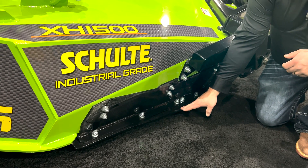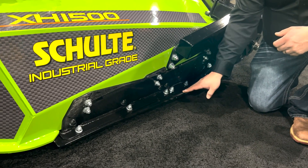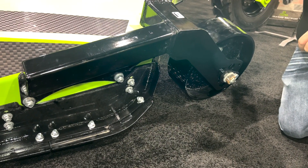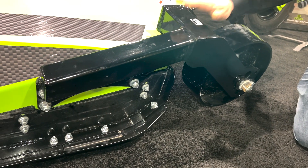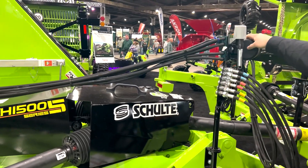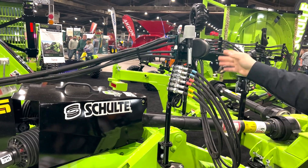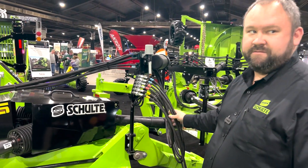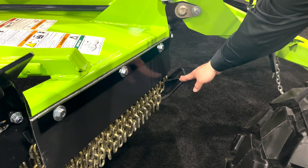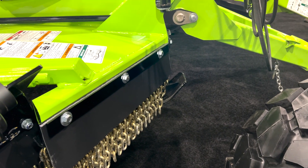One and three-eighths inch threaded adjustment on your wing height. Rear replaceable cast iron skid shoe, as well as front and replaceable side skirt. Right and left gauge wheel is optional on the Series 5 cutter. Newly designed hose organizer which can be moved and adjusted side to side according to the tractor you're using with the machine. Replaceable centre cast skid shoes as well, with rounded off edges to reduce scalping while turning and cutting.